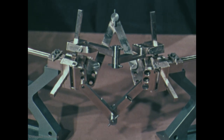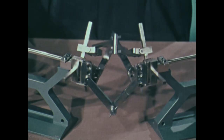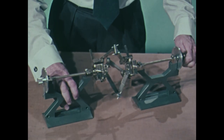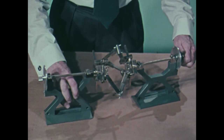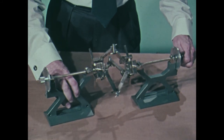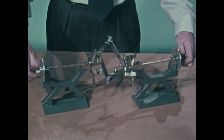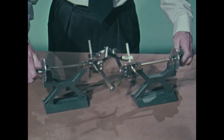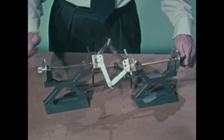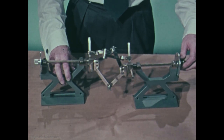It's tripled up and transmits uniform speed between angled shafts as expected. But as it turns out, the theory has been stretched too far. Look what happens when the shafts are in line — the coupling is now quite unable to constrain them to intersect at the geometrical center. It has all become slack. Now we find that the shafts can freely move apart parallel with one another. And when they are apart, the coupling works between parallel shafts, again transmitting uniform speed ratio, and then the coupling maintains the shafts parallel to one another while still allowing plunging. This is perhaps rather unexpected.